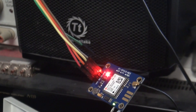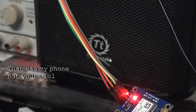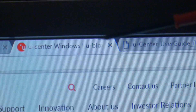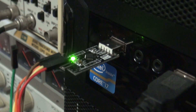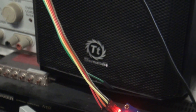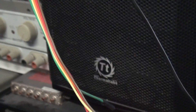To program the GPS board you need a software called uCenter, made by uBlox. Just download that software from the net, install it, connect the GPS board via one of these little UART boards — they're only a couple of dollars on eBay. That connects to some pins on the back of the board. Run the software, program it to whatever frequency you need up to 15 MHz. You can see the visible satellites on the screen which I'm just going to show you now.